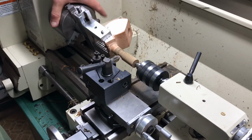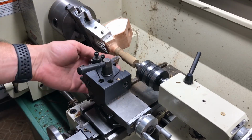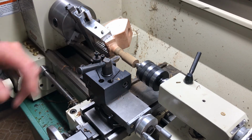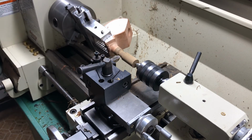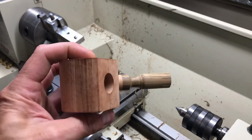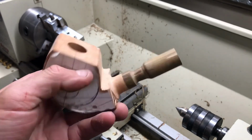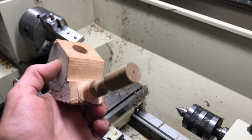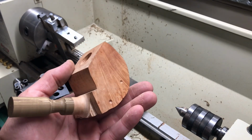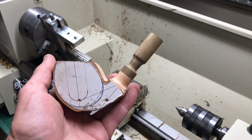Okay, it's pretty good. I need to go ahead and sharpen up my tool. The cut isn't as clean as I want, so when you're working with a metal lathe, you always have to keep these just razor sharp, especially working with acrylics or the Cumberland ebonite type stems. Okay, just took this off the lathe, so now I have the stem and the shank matched up. And really my next step now is to take it to the French wheel to start my actual shaping.